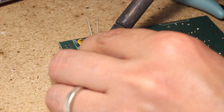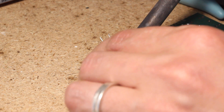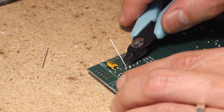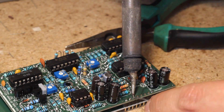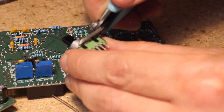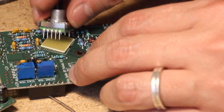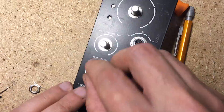Then add the headers and the electrolytic capacitors, paying close attention to their polarity. Negative is marked with a line on the silkscreen. Sometimes these capacitors get pressed down horizontally against the board so they'll fit between boards — pay attention to that. Same goes for the resettable fuses; they usually get bent down flat against the board. For the headers, it helps to use both boards together to line them up and make sure they're straight and everything will fit. Place the panel components without soldering them, mount the panel to make sure everything lines up and then solder. On this VCO there's an octave switch which needs to have its positioning tab clipped. You also need to place the included small plastic square underneath it to correct for height. Don't forget the mounting screws and spacer to hold both boards together firmly.